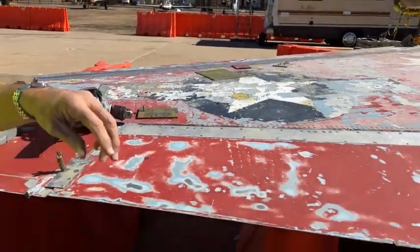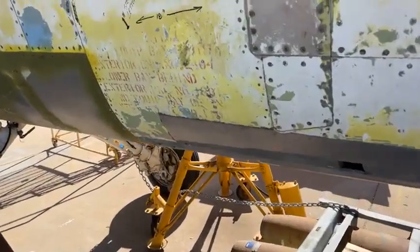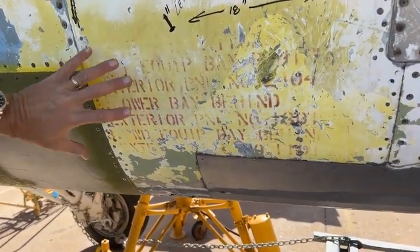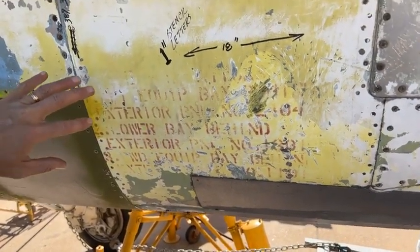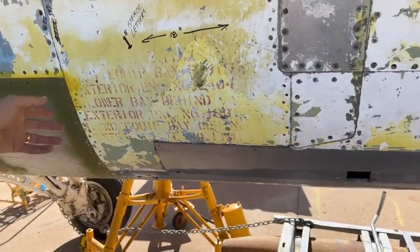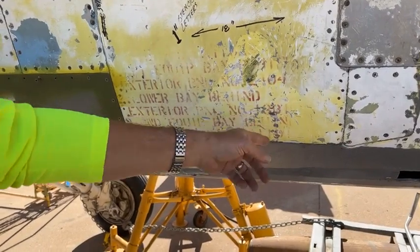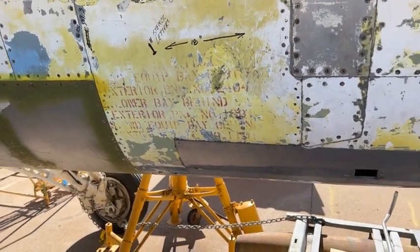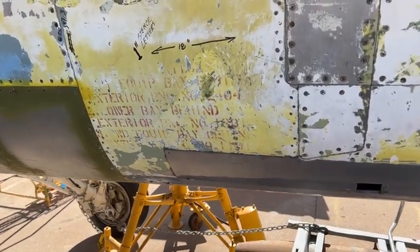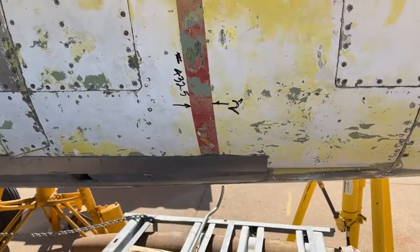Everything else — the blue border, the red and white stripes on the sides — are all ratioed off that circle so it always stays in proportion. By measuring, we know this is a 30-inch star, and we took dimensions on how far it is from the trailing edge and how far it is outboard on the wing, so we can put it back in exactly the same place when we repaint. The other markings you see on the side of the fuselage — there were markings in the prototype days telling you there were three batteries in the aircraft and where to find them. We found the full text off a model airplane decal sheet, because the model airplane guys have detailed all these things thoroughly.